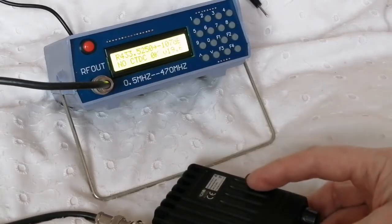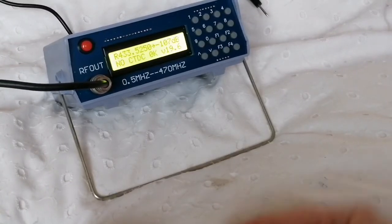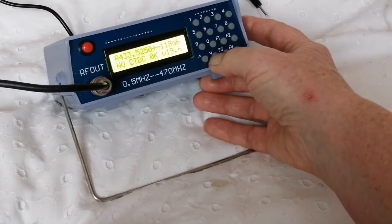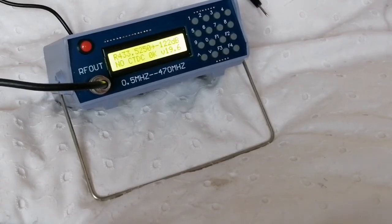We have a smooth noise signal. I'll take the radio out of the way, defeat the squelch and step this down. There it is — can you hear those rough noise pops? Turn the volume down a bit perhaps. I usually reckon on about 10 pops per second.